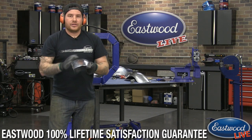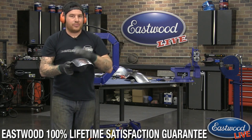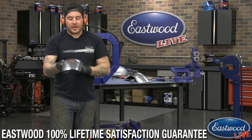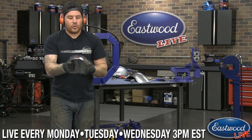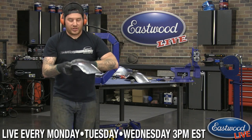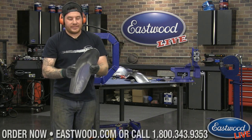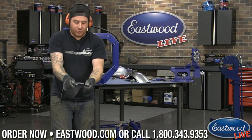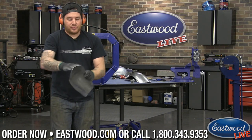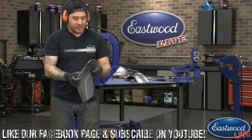And what you might have noticed is I was going really slow in those areas, letting it stretch that area up with a little bit higher pressure. And then I came back and worked it quicker at the ends just so I could blend the two areas together. So we're just flowing everything together. So that's why I was working it the way that I did. So now I can turn the pressure down just a little bit and blend a little bit more, and then we should be ready to put some strengthening in it.